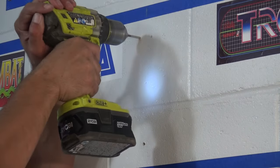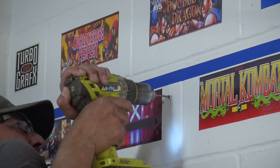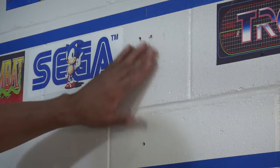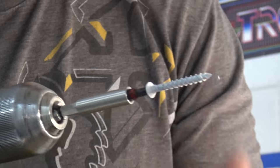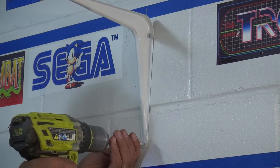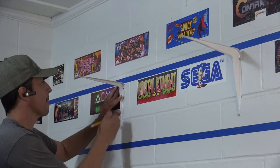Sometimes when you're drilling, you may run into a spot where the drill bit does not want to penetrate the wall due to reinforcement inside the wall or some other unusually hard material. For these situations, your Tapcon drill bit may be worn out and might need to be replaced, or you might need to use a heavier duty drill, or you might have to slightly relocate where the bracket goes. Then after drilling the holes, it's time to blow the dust out. Next, I can start installing one of the shelf brackets using the Tapcon anchor screws and my drill with the hammering function off. During this step, I make sure not to over-tighten the screws — I just get them snug to avoid stripping out any of the holes. So this whole process becomes very repetitive: first you mark the holes, then you drill the holes, then you install the brackets.